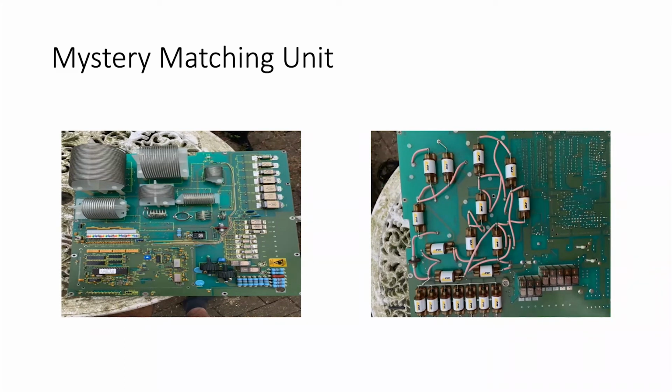By the way, the relays on the right, those white things on the right, are 3.5 kV at 6 amps. They can switch. They're vacuum relays. They're 130 pounds each. So when I saw the board up for sale for 45 pounds, I thought that was a good investment. In fact, I use those relays in my big valve linear, and they're excellent relays.